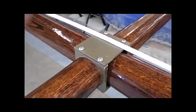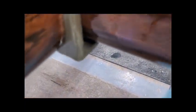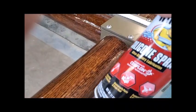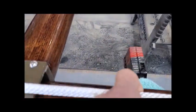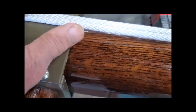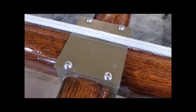We're back on the yard arm install. Once we set the bottom of the bracket on the pin first, we siliconed everything — all the wood and the bracket — because it's a very tight fit. We slid it up with one of us on either side, removed the halyard, and set the plate in place, then tightened the four nylock stainless cap screws.